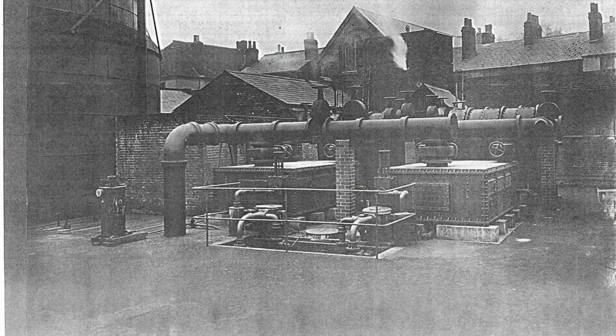For our purposes, we chose to build two smaller units side by side based on this photo. The gas pipework seems to be arranged to allow one or other of the units to be in operation or both at the same time. Presumably this was to allow for maintenance work. The size of the unit is based on counting the bricks in the supporting columns for the pipework.